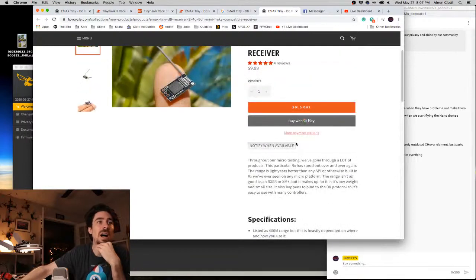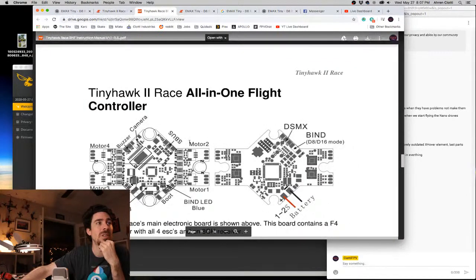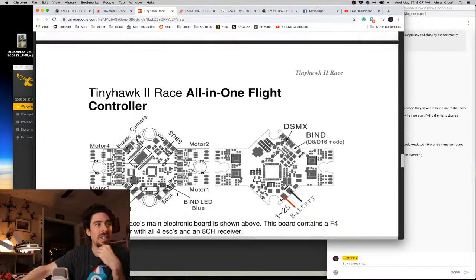So, I soldered it up to the, yet again, differently labeled here, so it says TX2 here, next to the boot button, but on the board, it's silkscreened RX1. So that's what I put this S-bus on. I put it on RX1, and I made UART port 1 serial. I flipped the serial switch on. Nothing. Nothing at all.